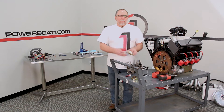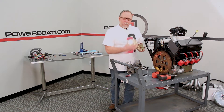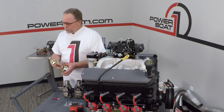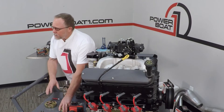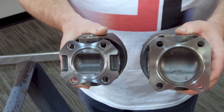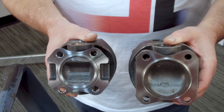You've got two different PTO sizes: a 1310 and a 1350. This one is for a flex plate style where it's got the little register cut in the back. This one's for a flywheel style where it'll fit in the back of the flywheel. The bolt pattern difference is between the two — a 1310 is 2 inch by 2 and 3/8 on the bolt pattern, and a 1350 is 2 and 3/8 by 2 and 7/8.